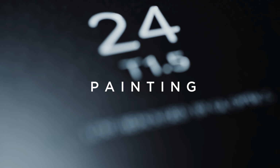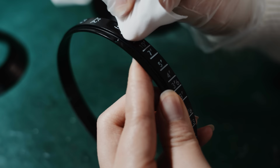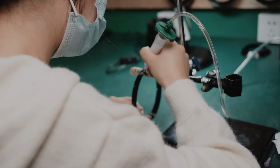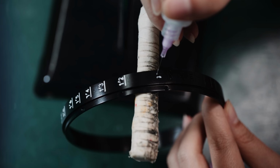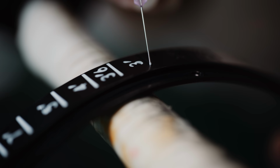After anodizing, the markings can be painted in. As said before, the customer can choose the colors he prefers. Of course, only to the extent as paints are available. This is another one of those manufacturing techniques that will give you a whole new appreciation after you have witnessed the process. Every number, every mark, every letter is painted in manually with a syringe type of tool. Color is released from the syringe when the pedal is pressed.